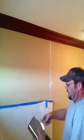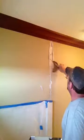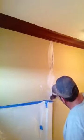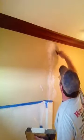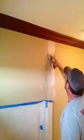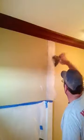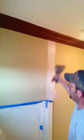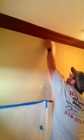I'm gonna put mud on this first. I fill that hole full of mud, pack it in there. Okay. Pack it in. I'm gonna work it in them holes. Pack it in there so that there's no air behind it. Okay? Then I'm gonna cover the entire thing with mud real thick. Alright, as you can see, it's real thick through there. You can't see the paint through it or nothing like that. Take paper tape. I'm gonna put it on here like this.